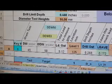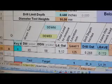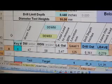And on it goes. If the down weight instead of 45 was 47, 47 grams was our test with the gram weights, but we want 50, so we need to remove 5.47 at this lead position, drilling out 161 thousandths and leaving 279.